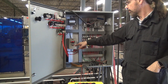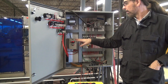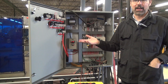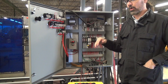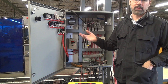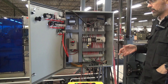The VFD is fan-cooled. This machine is currently set up to run at about 3 inches per second based on a VFD speed setting. The base speed of the table drive motor is 60 Hz — it's a high spec motor that can overspeed to about 3 times that, though I don't really recommend going that high. Right now I have it set to a maximum speed of about 90 Hz, so 3 inches per second. The speed range is about 50 to 1, and the minimum speed is around 0.02–0.03 inches per second — really quite slow, which is what a lot of my customers need.